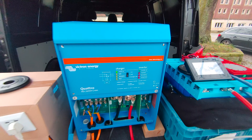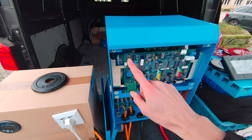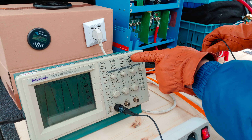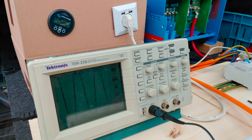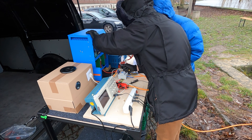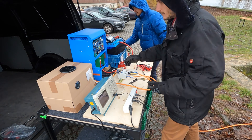The real problem we had at that point was that we couldn't get the charger to run. It would turn on for a second and then turn off again. After some time troubleshooting, trying different programs on the inverter — which is done by changing the position of eight tiny dip switches on the main board of the Quattro — we even looked at the shape of the sine wave of the power coming from the generator, but it turned out to be quite beautiful actually. Eventually we found the issue and fixed it.